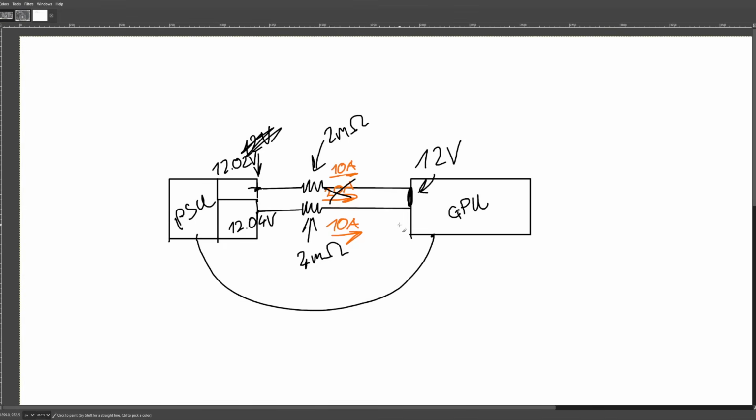Admittedly, AMD did screw up with, say, the RX 480, where they accidentally put a little bit too much vCore onto the PCIe slot, but they were able to patch that. Actually, I don't think it's even a BIOS update. They patched it with a driver update that basically just told the voltage controller to bias towards the top 3 phases that were hooked up to the 6-pin, which meant the GPU would slightly overload the 6-pin rather than the PCIe slot.